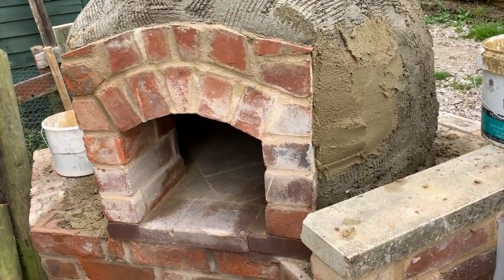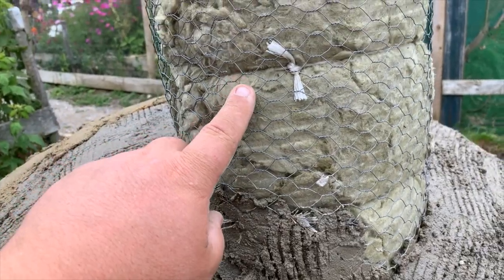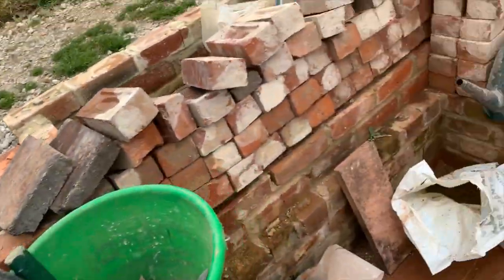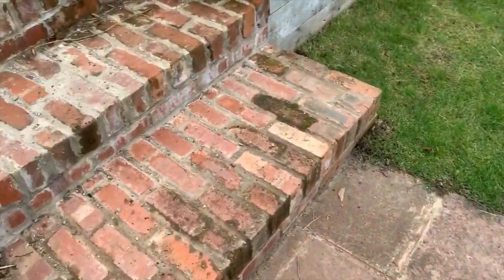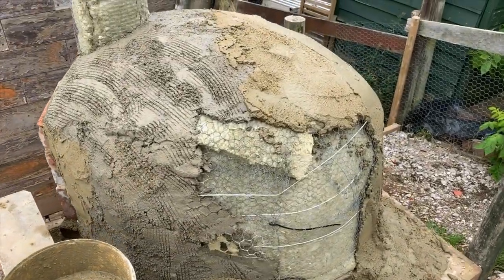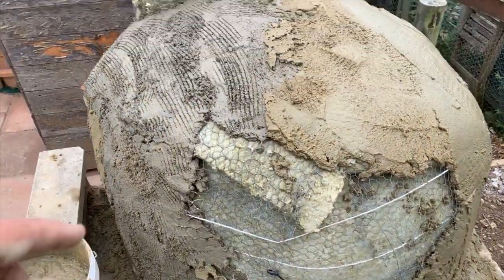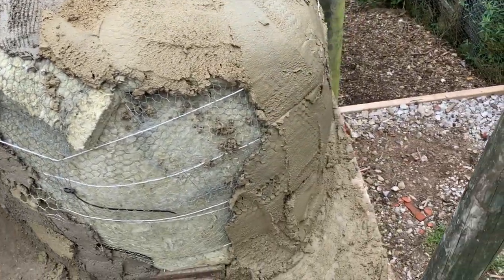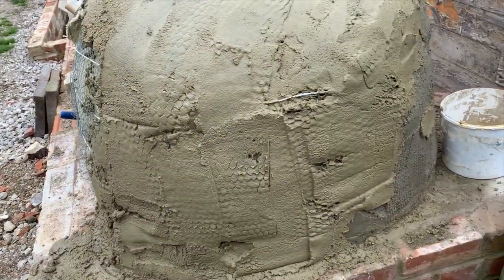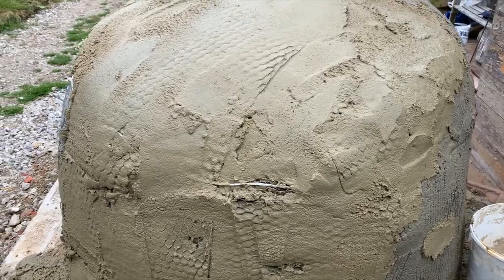So we're on to rendering. I did a bit yesterday but couldn't do any videos because there were too many people here. On top of the fiberglass there's the chicken wire. You really can't be too precious with this — your first coat is going to sag a bit in spots, it's going to be a bit rough in spots. The different colors are just because of different sands. You literally just have to daub it on. You can see that's where I've scratched it yesterday — you've got to roughen it up so that the next coat sticks.